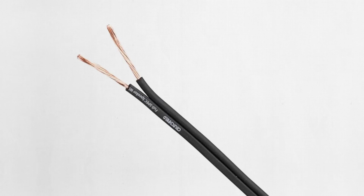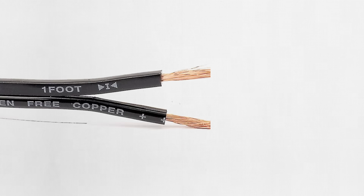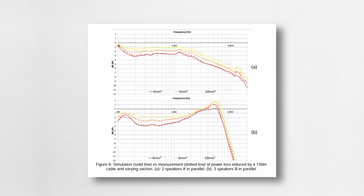For this reason, I'd recommend 16 gauge for most home and studio uses, 14 gauge for longer runs or higher power requirements, and 12 gauge for extreme runs or special pro applications. But bigger rarely helps beyond that. To bring this point home, upgrading from 6mm² to 10mm² wire might yield less than 1dB improvement at 10kHz, according to the L-Acoustics paper. This is technically an improvement, but it's likely far from cost-effective considering the price difference and the difference in workability between these two cable types.